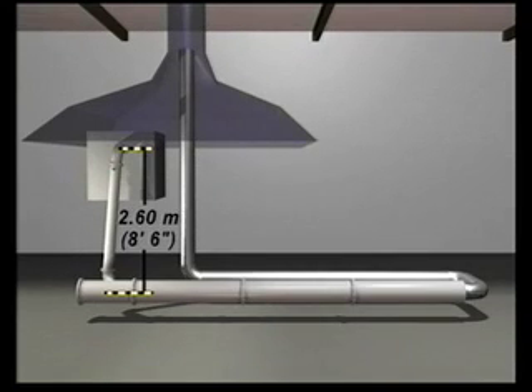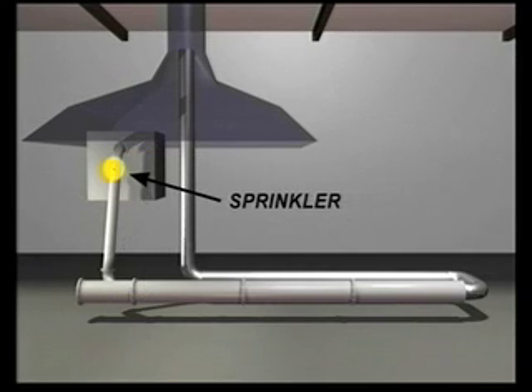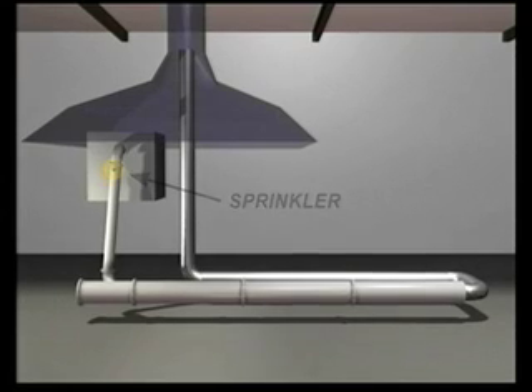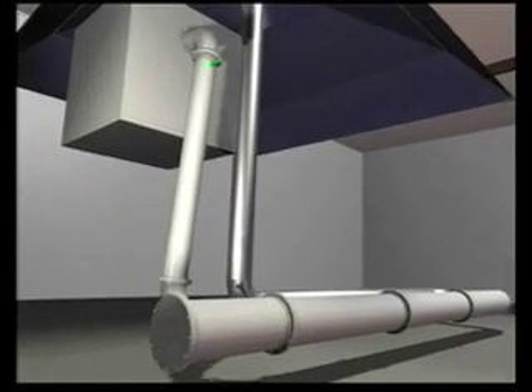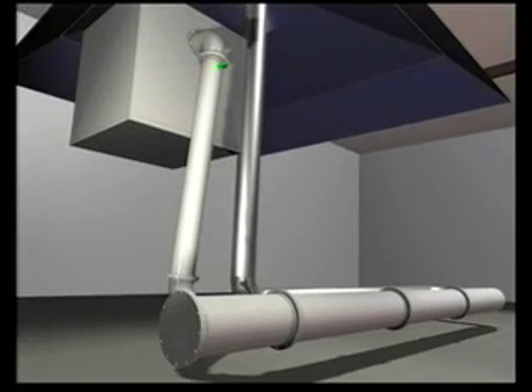The next piece is a 200 millimeter diameter 90 degree elbow connected to a 2 meter (6 foot 6 inch) riser duct, and then a 90 degree elbow which is bolted to the enclosure. The air flow rate was set at 6 meters per second, 1200 feet per minute, in the 200 millimeter line.